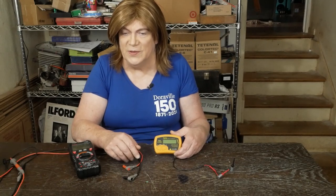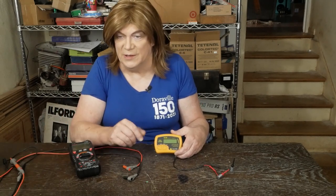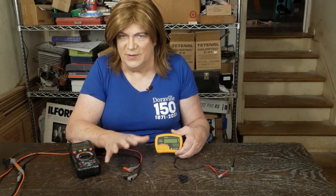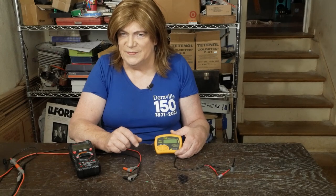A lot of the cables I was going to use with the new turntable got up to like 400 pF — that would have destroyed the sound and I'd have been going 'why does this turntable sound like crap?' when it would have been the cables. The cheap cables it comes with are actually real low capacitance, so you won't go wrong using those. World's Best does make some ultra-low pF cables with nice Canare connectors that match the stock ones but look better.